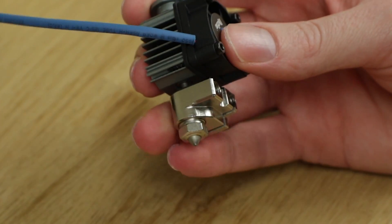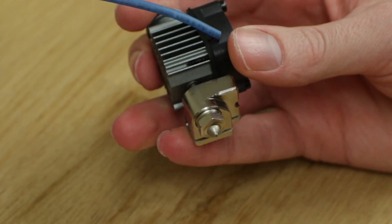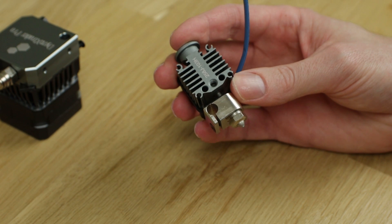You'll also notice the metallic shine on the nozzle, which you wouldn't get from a ceramic material. It's in fact an electroless nickel plating — basically a low friction coating which covers the whole nozzle, including the inside. The inside is where it's important to get low friction movement between the plastic and the nozzle, meaning you have better flow and less back pressure for better print results.